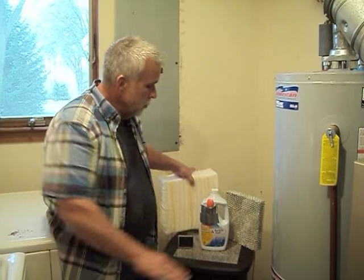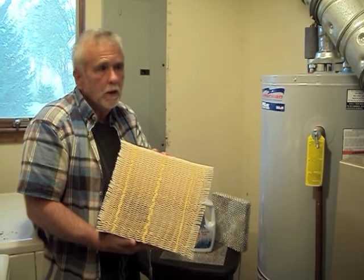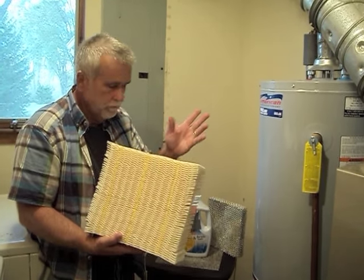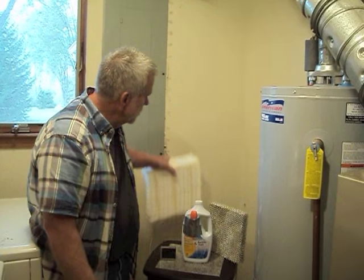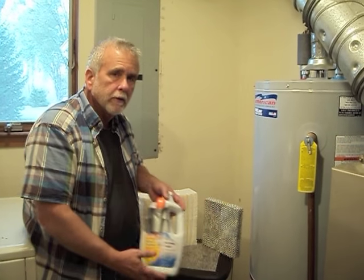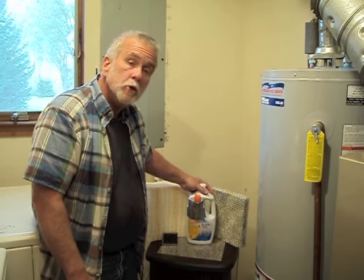The stand-alone unit has a wick like this, and again you will be changing this yourself — it's very easy to do, just pop the old one out and put the new one in. I do mine twice a year. If you're going to use a whole-house stand-alone humidifier, do yourself a favor and buy the appropriate type of bacteriostat. It will help keep the odors down and the unit much cleaner.